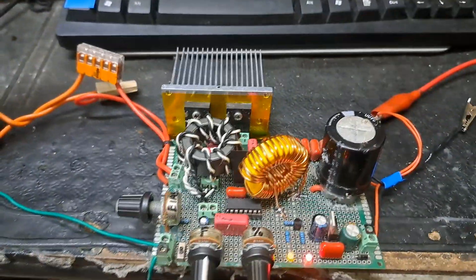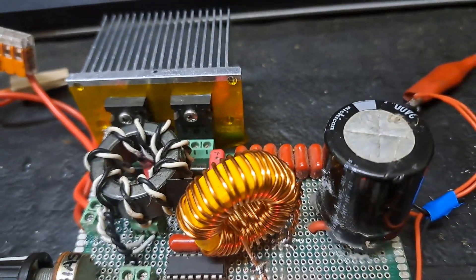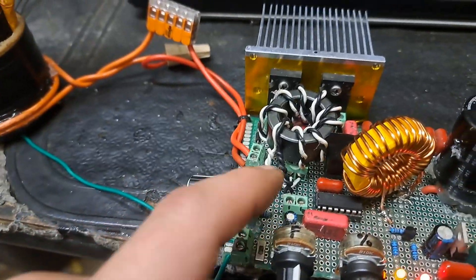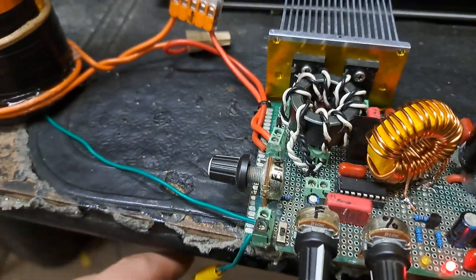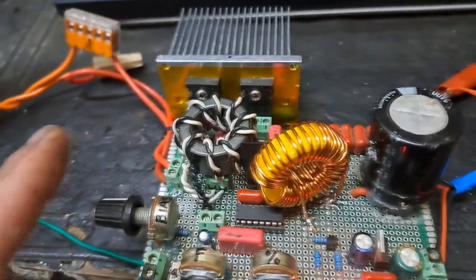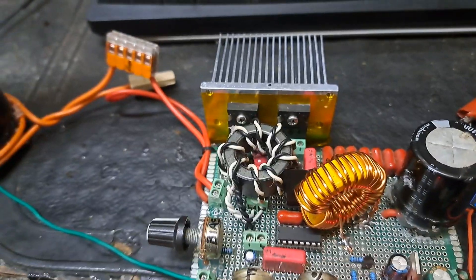I figured I'd show the circuit again before I get rid of it. This is basically an old push-pull circuit. I got IRF-P250s on there, some cheap Amazon ones. I just got the secondary going through, primary going down to ground. And I wound this coil right here for 36 gauge. I haven't really tuned around with this thing or anything like that. The whole point of this board was just to sort of see how many different types of coils I can just throw in here and get decent output.